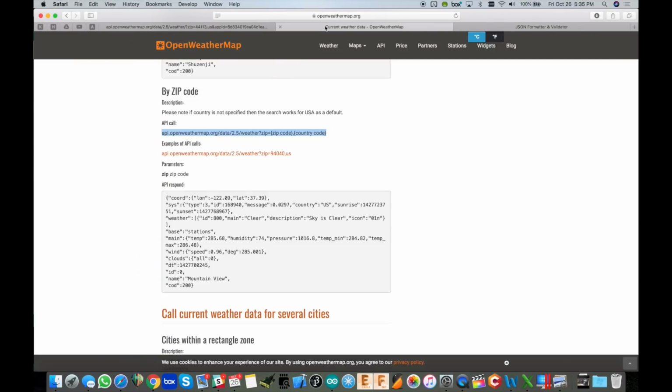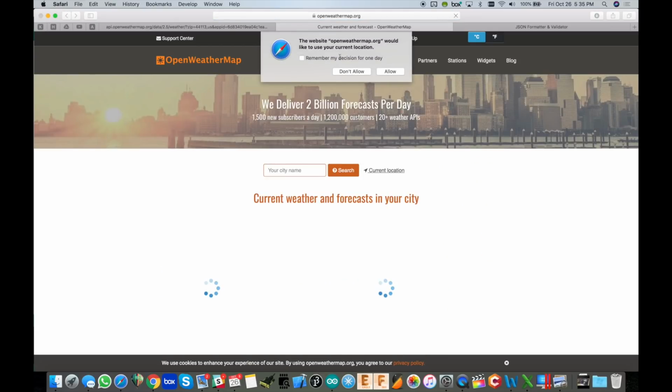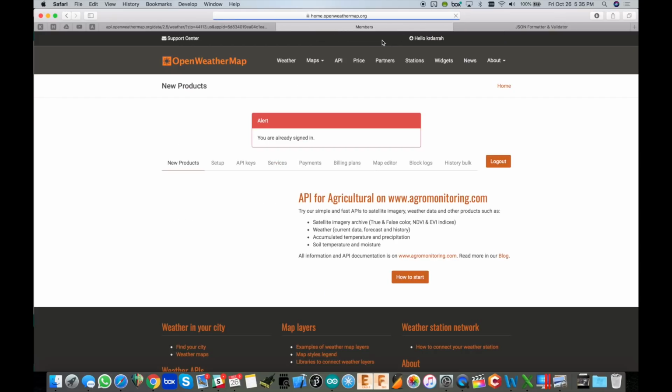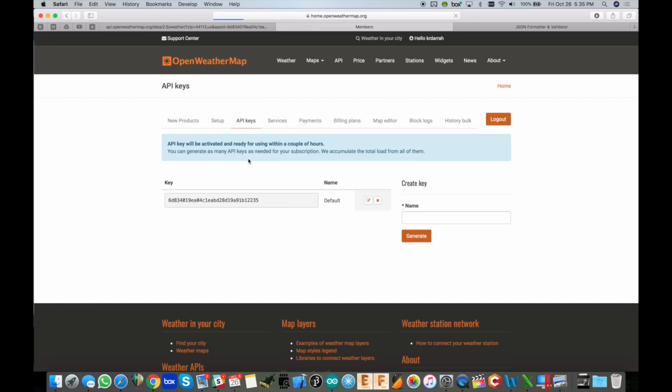And then running over here to openweathermap.org, this is where we're actually getting our current weather status from, and this is what gives us that keyword clear that we're using to determine if we have clear skies or not. So you will need to set up an account with them and get an API key. So I already have that, and I'm just going to share my API key with you here. Of course, I will delete it after making this video, but don't really feel like blurring that out every time you see it. So anyway, you will get a key.